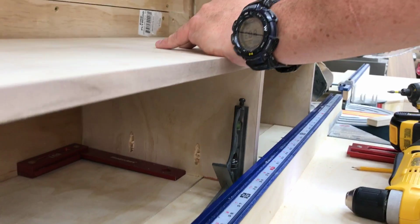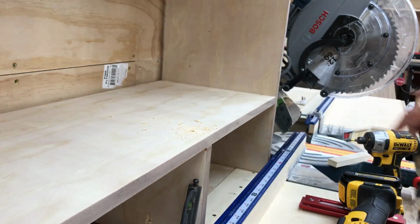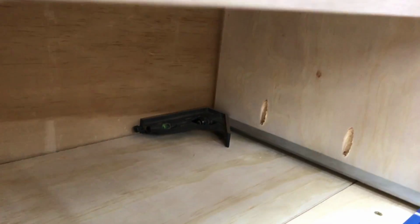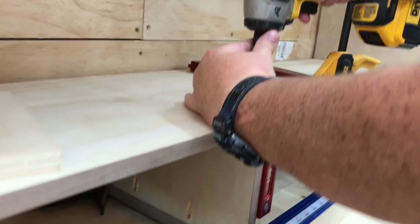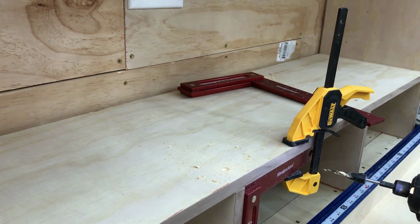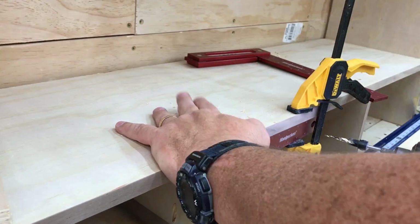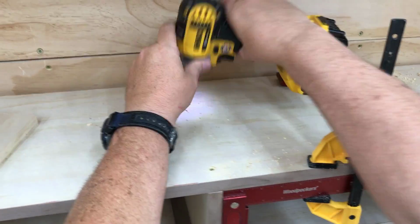Alright, to get those vertical pieces actually mounted in place, it's a little bit tight. It's easiest if we start at the top. I use a couple of squares, maybe 3 squares on the bottom, to make sure I'm square with the back wall and that the piece is plumb. These woodpecker's squares are actually 1/4 of an inch thick aluminum.